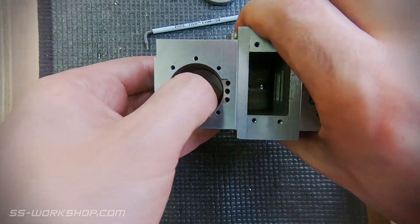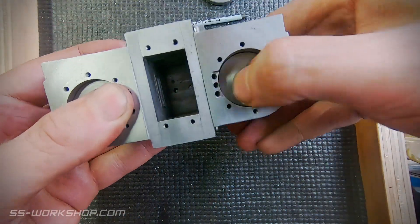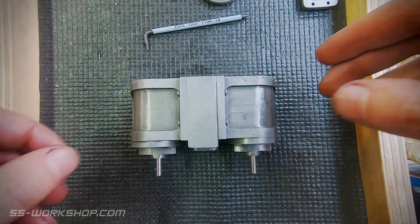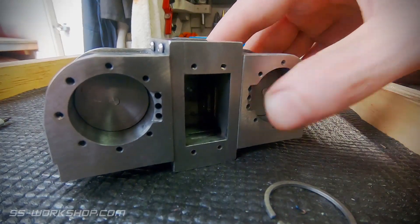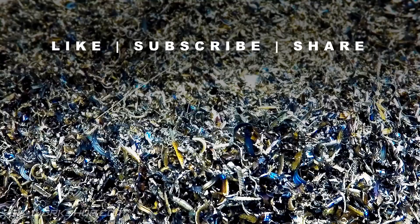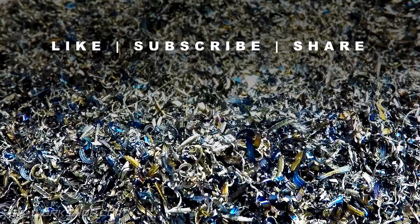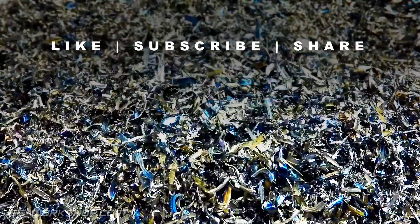I'm really surprised how successfully these worked. This is the first time I've made cast iron piston rings and I really didn't know what to expect. They turned out to be easier to make than I expected, but the hardest thing was to part them off at the correct dimension. Now I just have to hope they'll work as well when they get some steam behind them. I'll definitely be making more of these for the outside cylinders. Thanks for watching and if you enjoyed this video please like, subscribe and share.